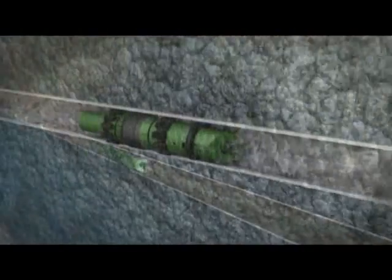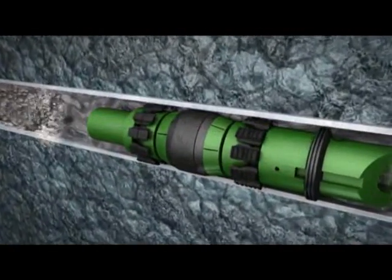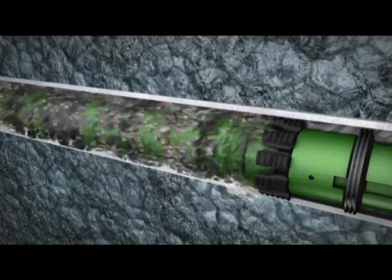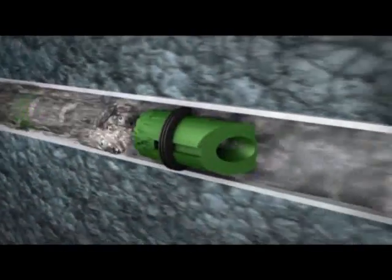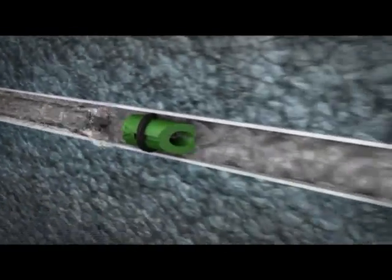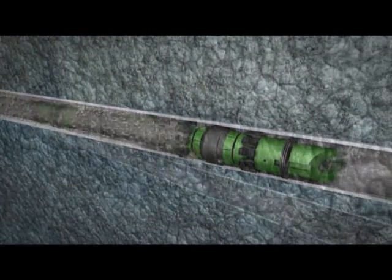While keeping recommended RPMs and set-down weight on the bit and plug, it is ideal to take 20 to 30 minutes to drill the plug up into small manageable pieces. This will prevent problems with drilling tools and/or surface flow back equipment.